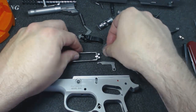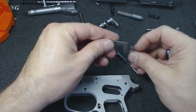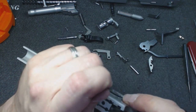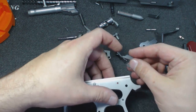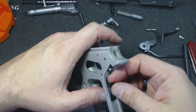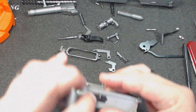So we can try and think about how some of the other functions work. So the ejector and the hammer drop work in the exact same fashion in terms of creating a trigger disconnect. So how does the hammer drop get our sear out of the way? How does it allow the sear mechanism to come off? And I think one of the easier ways to do this might be to actually cinch the sear back in, and if we can get him back in place, then we might be able to illustrate some of these things a little bit more easily.